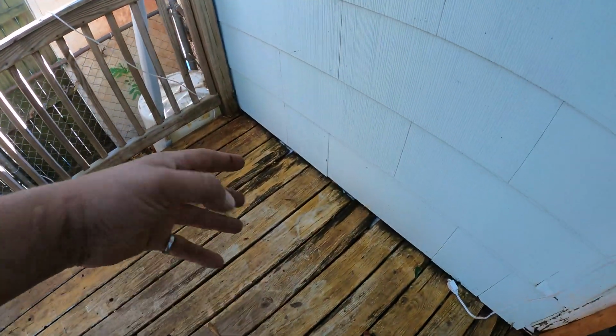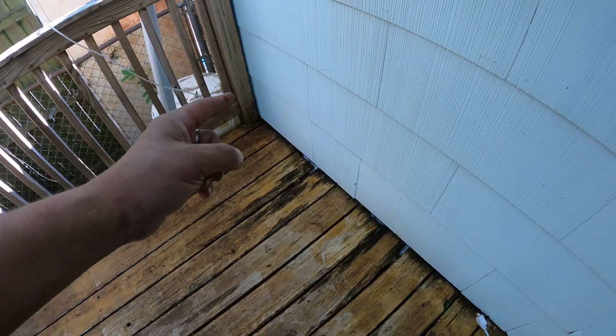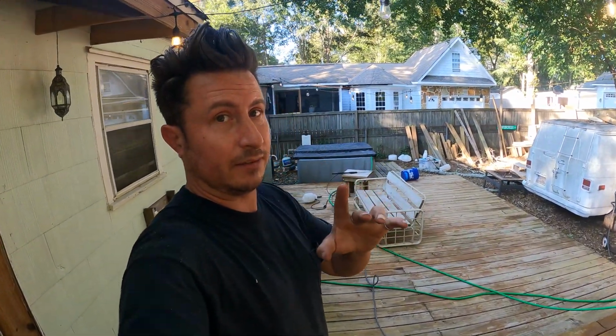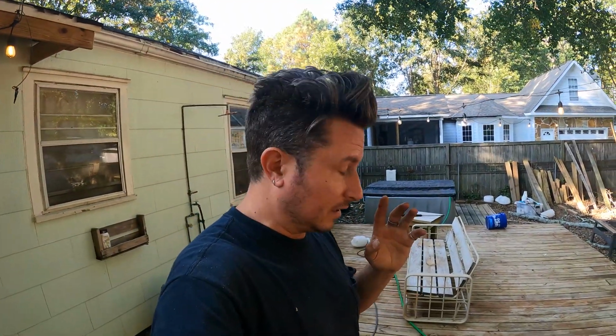However, our more rotten spots have absorbed more water, which makes sense, but that's really important for us to get stain down in there, which is oil-based. So we're going to let this dry overnight. A lot of this was done with our Back Saver 3000 liquid deck cleaner. Use whatever kind you want. I'm just telling you, it saves a lot of pressure washing work.